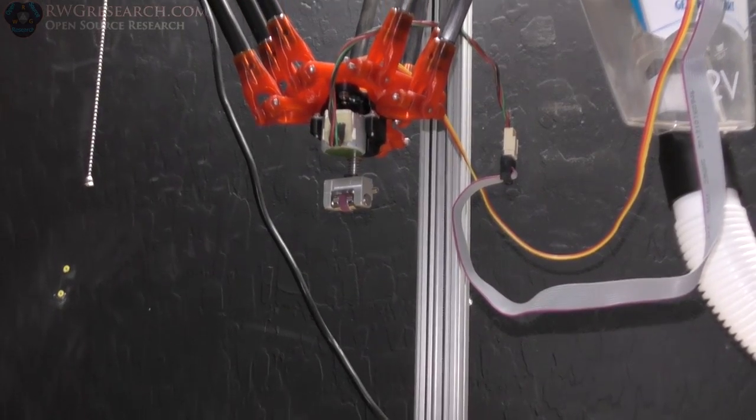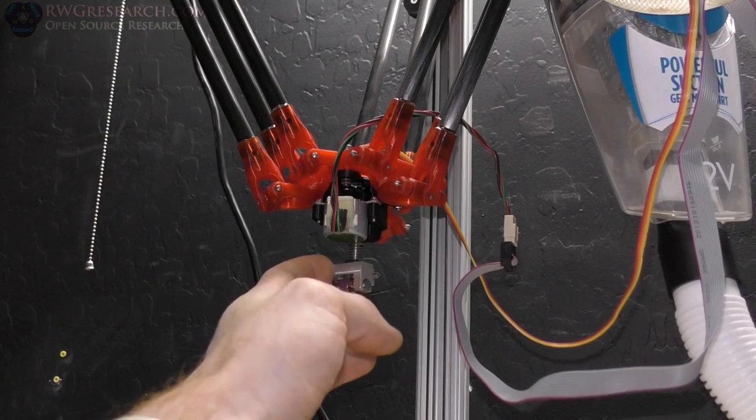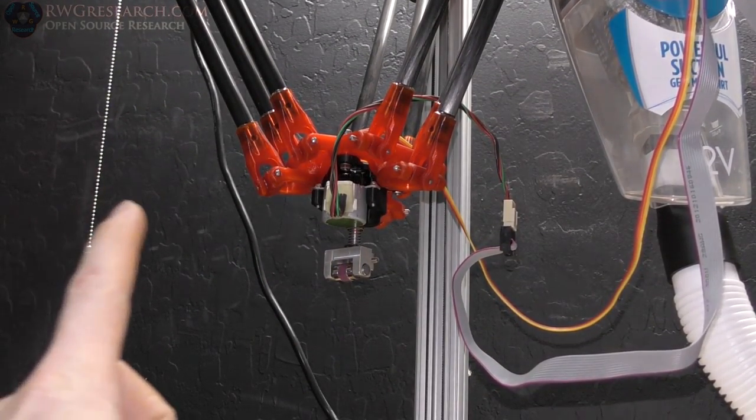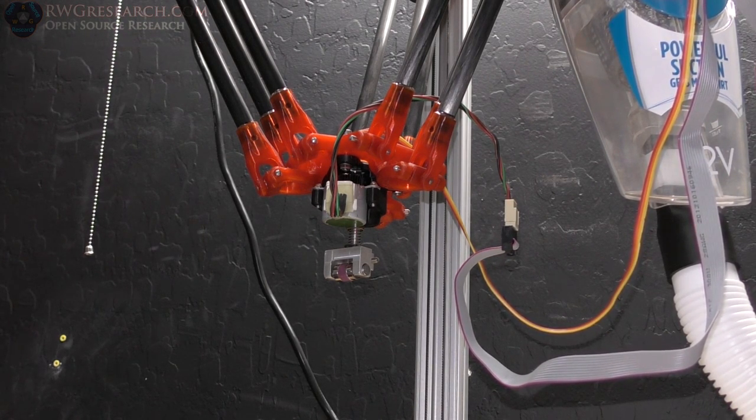So a couple problems real quick to talk about. First of all, this is a point-to-point-to-point. And so, like I said earlier, if it's going to be running into a circle or a square with corner radiuses, we can throw G2 and G3 commands, which are counterclockwise or clockwise arcs. And then you could put all that on the same line in the G-code, and it would probably be just fine. It would follow that to the next position. So that's a good thing.